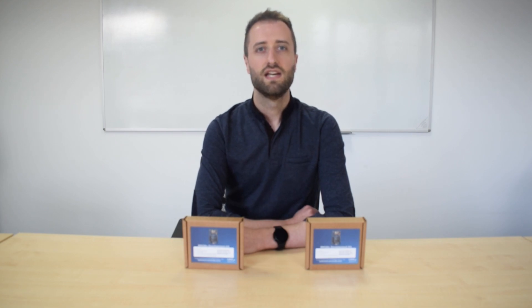This is a LoRaWAN module based on the association of the EFR32 MCU from Silicon Labs and the SX126X from Semtech. It can support LoRaWAN class devices A, B, and C, as well as LoRa peer-to-peer transmission. This device can operate with either an AT command set or it can be programmed with C code via Silicon Labs Simplicity Studio.